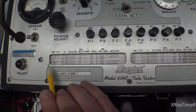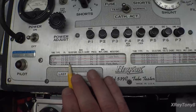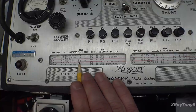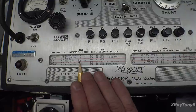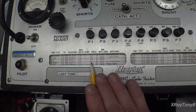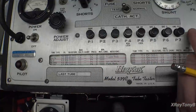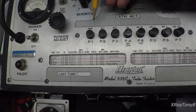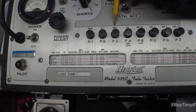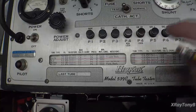Looking at our settings for the 6L6, you can see the filament is 6.3 volts. Then here are the selectors. You actually apply a bias voltage — in this case 3 volts — to the tube, and that's the bias you're going to put on the control grid. You're going to push button P4, which is this one here. Each one of these buttons is a different type of thing you're testing — for instance, if you have a diode tube, a voltage regulator tube, or a rectifier like a 5U4. And then there's GM, or mutual conductance — that's the button we push because this is going to be a mutual conductance test.